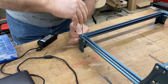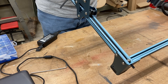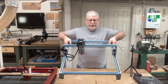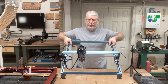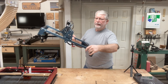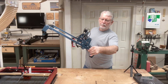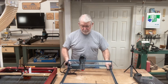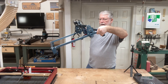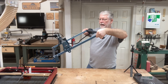We'll do the same thing over here. Now we can raise this up much, much better. Let's test this out and see how it's doing. Just a little bit, and it makes all the difference in the world. You can see how I can hold this up and it's very slowly coming down. Much better. Tilt that down to about a 40-degree angle and it just slowly slides down. That's what you want.